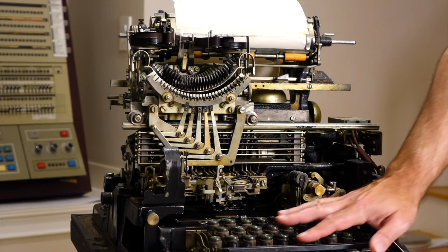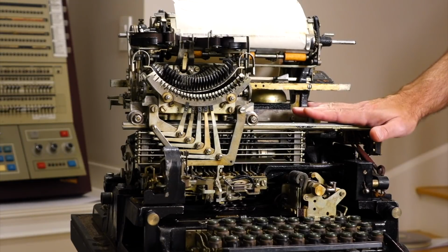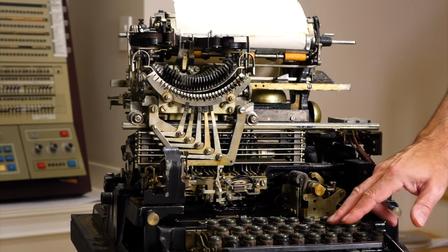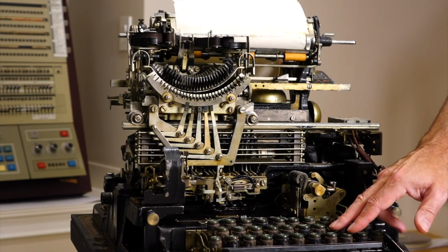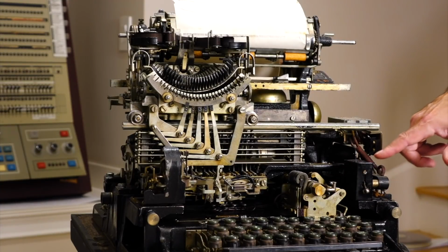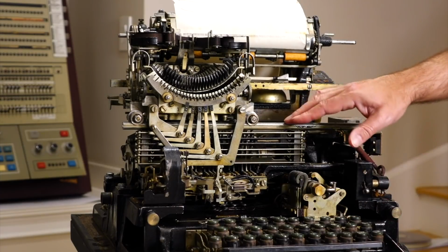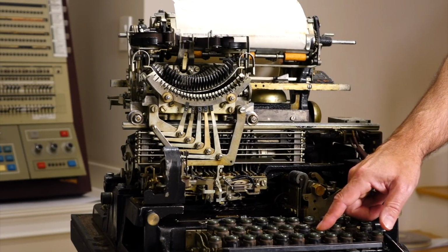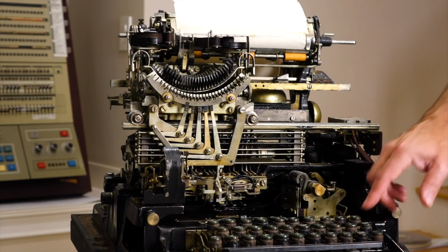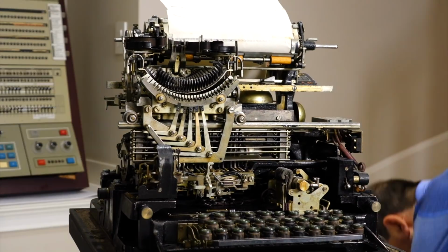Basically this one consists of a transmitter and a printer, and the 2 are not connected at all mechanically. So if you want to actually see what you're typing, you must connect the 2 in series by an electrical line, so that the printer sees the code sent by the transmitter. And that's the only way you will be able to see something printed.